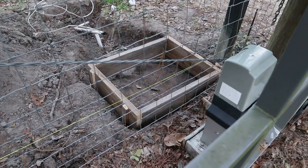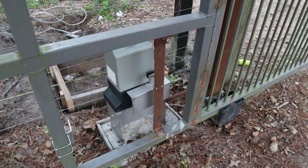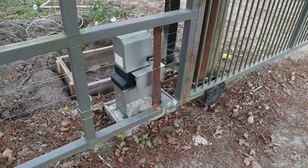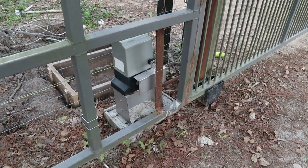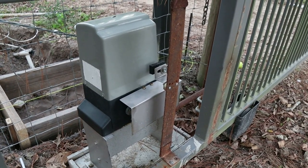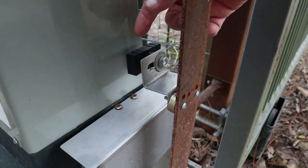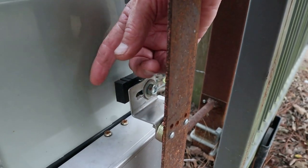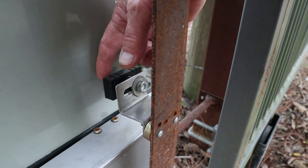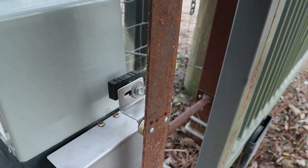You can see the pad I'm building on the inside yard side. Let me tell you what happened and why I'm having to renovate this. The sensors — or magnets — are what tell the gate to open or stop when you engage the remote control. The clearance between the housing and where the magnet sensors are is pretty minimal. If they get out of range, it won't shut off and the gate will continue to close until it just binds up.